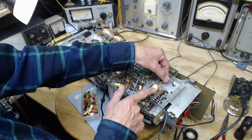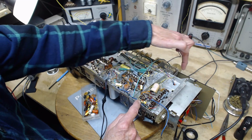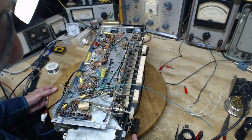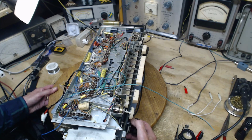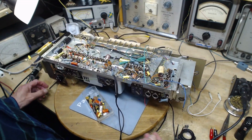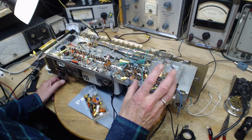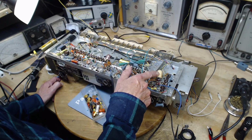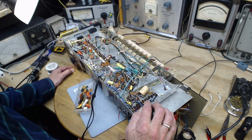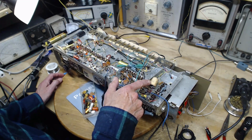I noticed these wires are connected, at least the green one here is connected right to one of the terminals of this capacitor. Green wire goes down here and eventually reaches a terminal and a lighter wire which goes into the back of this control where these buttons are. So I think this is the heart of the automatic frequency disabling when you squeeze that tuning control and you push those white buttons. So that's where this is in the circuit. Somewhere related to that. I also see the other side is connected to, I can see it quite clearly, a 3 megohm resistor. There are not going to be many 3 megohm resistors in the radio, so that should allow us to identify this guy pretty good.